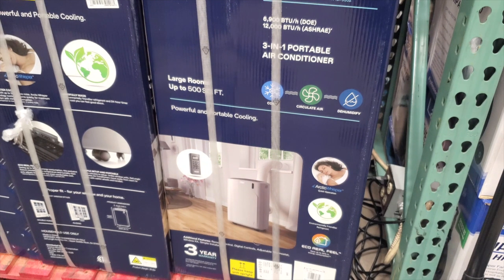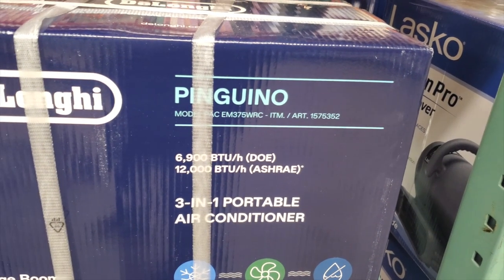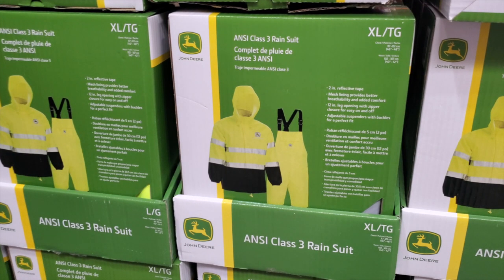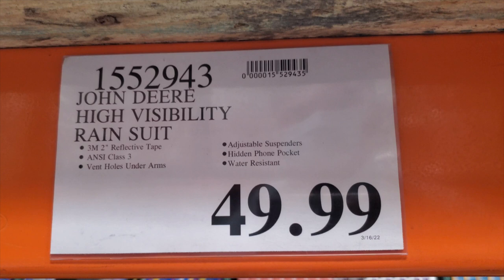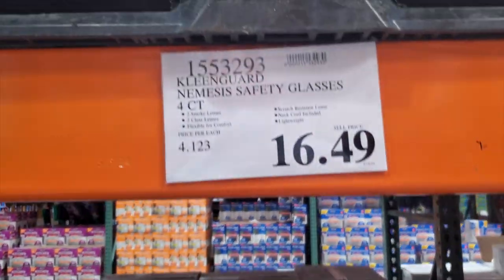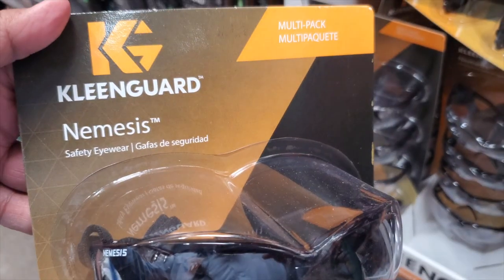You've got a shop AC or small room AC here. I wouldn't recommend this type — I've had bad experiences. We have extreme heat and humidity here, so I'd recommend getting a mini-split for the garage. Always size up for more power. If you don't want to pay for a mini-split install, you could get a window unit and cut a hole in the garage. But I definitely recommend a mini-split — it gets the room super cold and only costs about $25-30 a month running 24/7.